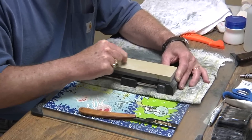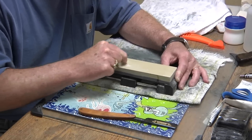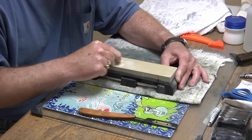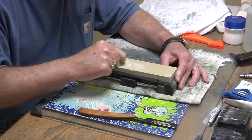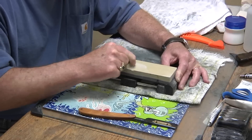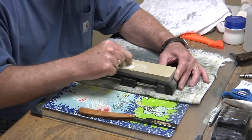While we're building up this slurry, typically I start with a lot like the regular circle process — 40 heavy circles followed by 10 to 15 X strokes, all on the heavy slurry. Then I start working the slurry down. Once I get to a medium slurry, I do 40 heavy circles and then 40 light circles, followed by just 4 to 6 X strokes. Then I take it down to a really light slurry for 7 or 8 X strokes, and finally at water I finish off with 10 X strokes.